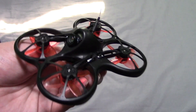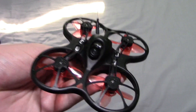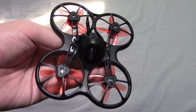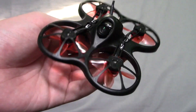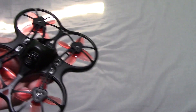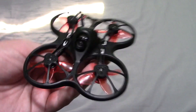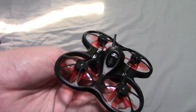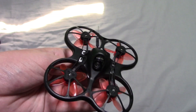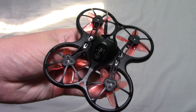The camera has decent range — you can get about 300 to 400 feet away before you completely lose signal, which is completely fine for this little one. There's no reason you'd be flying three or four miles away anyway, because you'd never go that far with the battery life. Speaking of battery life, this thing gets four to five minutes on 1S, and on 2S more like three minutes — though that's considering you're going full throttle a lot. If you're taking it around nice and easy, you'll get four minutes pretty easily. Now I'll show you guys some DVR footage, and after that I'll wrap up the video.